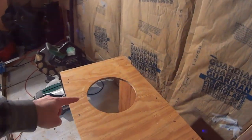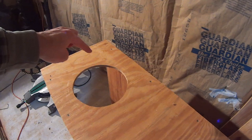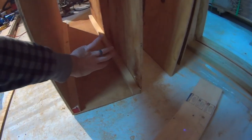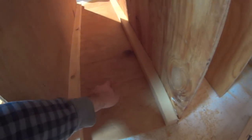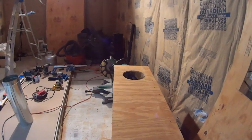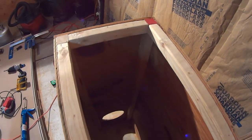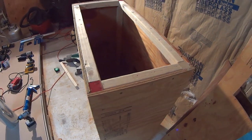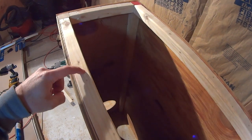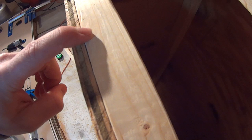I've cut one hole — this is actually the hole that faces down into the studio. Now I'm deciding where to put the other hole: out the back or up top as I originally planned, so one on the bottom and one on the completely opposite side. I've gone with the top. I took the 8-inch duct, placed it on the panel, traced it out, and I'll cut it out with a jigsaw. Now I have the framing on one of the ends — all the 2x2s in with a couple of screws just to hold everything together.